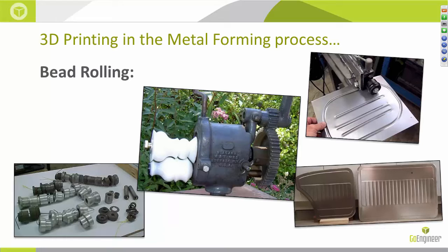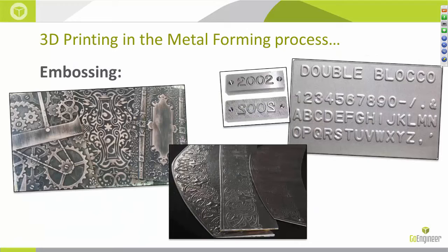You simply design your tooling and keep a digital inventory of the STLs and the build files so you can print them when you need them. And you aren't limited to the same geometric shapes — you can get really creative, like the picture in the middle. Now there is a disclaimer: with certain gauges of more workable metals it will be possible to 3D print the tooling, but I don't recommend trying to roll quarter-inch carbon steel, for instance. The pressures required are substantial and it's not that this tooling can't handle it — you just may not get the life you expect.